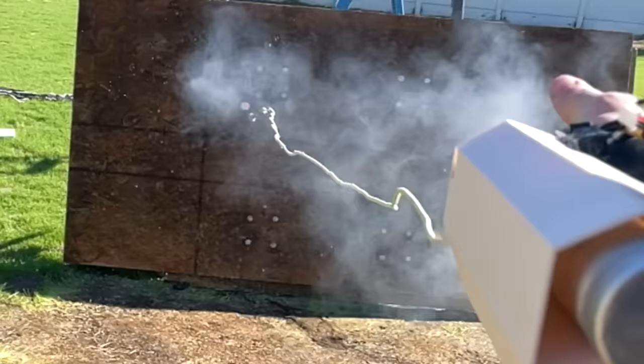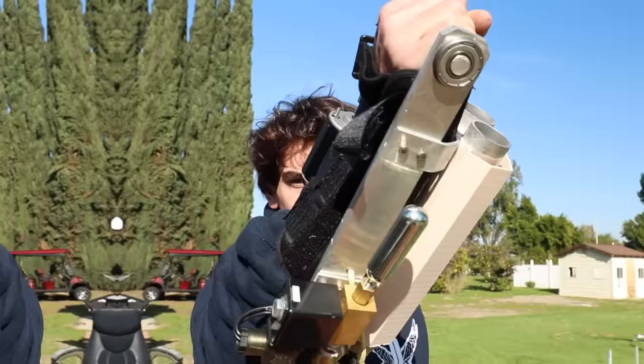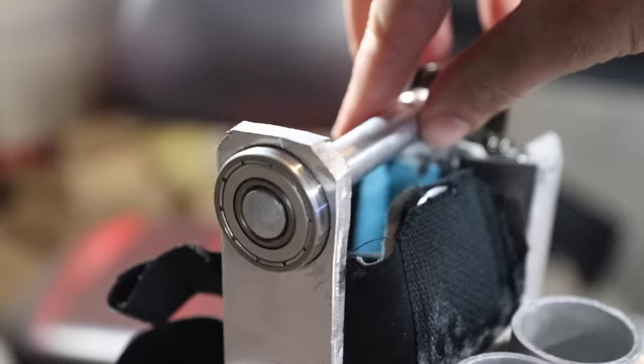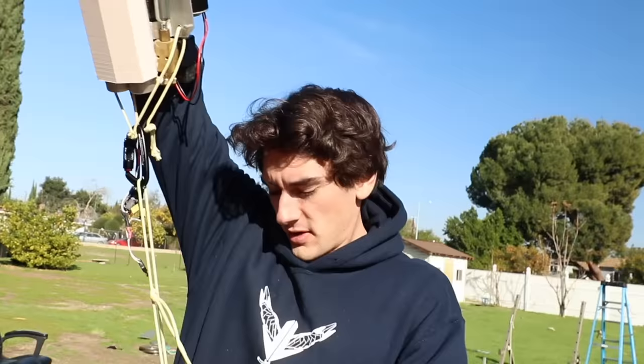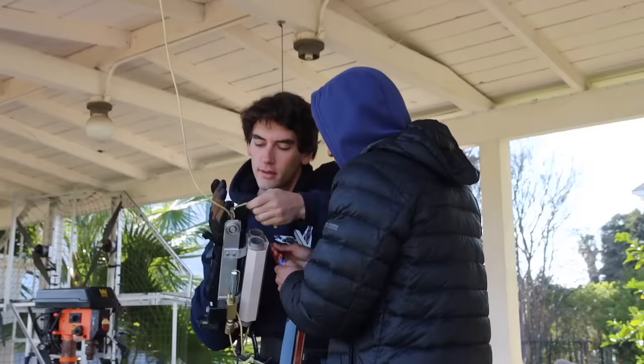But when I'm shooting the rope, there's a lot of extra slack that also comes out. The line needs to be tight for me to be able to swing. So I almost need a way to reel that in before I grab it, which this doesn't do. So I pivoted to this reel mechanism. Little motor right there, 90 degree angle joint. This thing will wind around the rope that we shoot, and it'll put the stress through this metal piece to this harness on my waist, and then hopefully I'll be able to hold the rope, and then when I let go, it'll spool off and I'll fall.